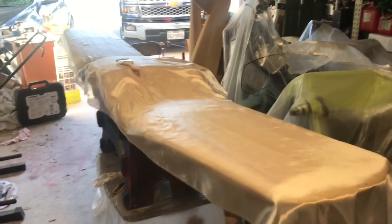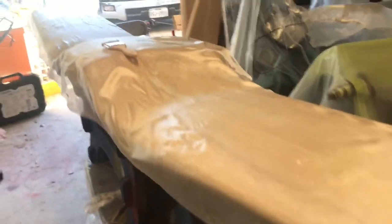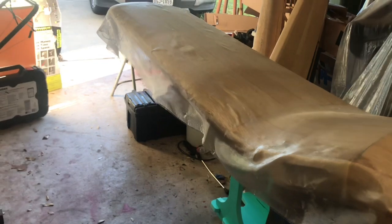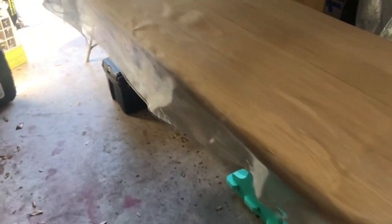All right, Mr. Fly Ride is right back at it again, going to finish up the top portion of the wing. Last little segment, I showed you what I was about to do with the bottom portion. So like I said before, now I have the fiberglass. I have laid it across the wing. I've cut out the excess so it overlaps, I want to say, about another 2-3 inches. So it overlaps on both sides.